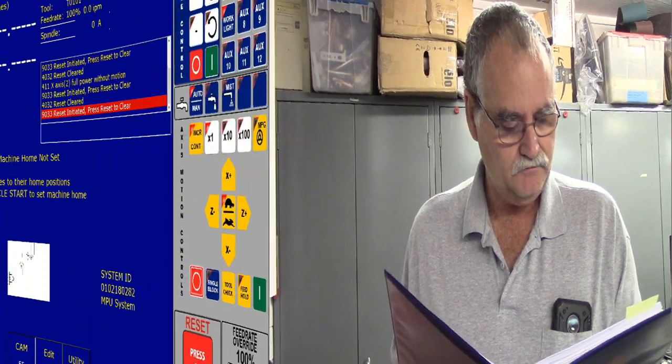What's going to be happening here is we're going to be loosening those screws and rotating the encoder on the motor shaft to align the encoder with the motor. Connect the power cable and encoder cable from the drive to the motor. Those are done. Power up your drive and control system running the Centroid CNC software. All right, so we're about ready to do that.